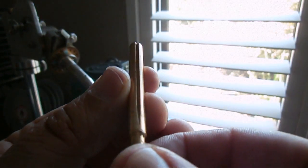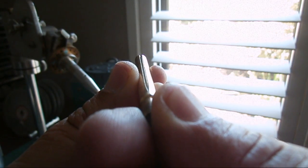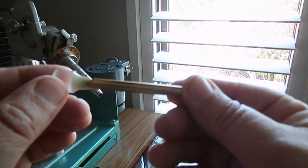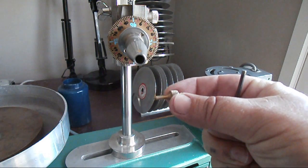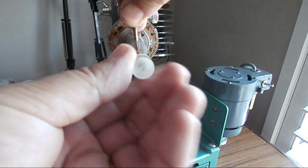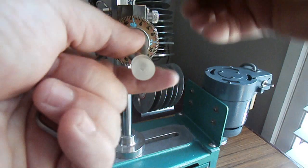Another common question is about the main function of the dop stick. The gem needs to be attached to something so you can cut facets at certain angles. Most dop sticks are made out of brass or stainless steel, sometimes even wood. Most gems are attached to the dop stick by two-part epoxy resins or wax. There is a slot cut into the dop stick that lines up exactly with the 96 or zero marker on the index wheel, which is attached to the quill mount. By sliding in the dop stick, a hole drilled in line with the 96 and zero marker allows a pin to lock into the slot of the dop stick, immobilizing it. Then a screw is secured with an allen key to lock the dop so it can't move.